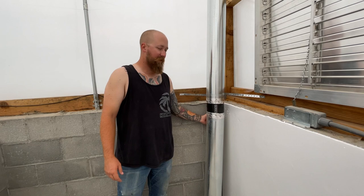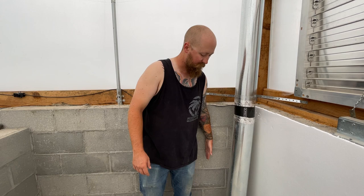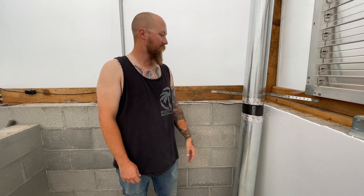And then this, I forgot to talk about this. So this is the geothermal tube. So we are just gonna use expanding foam, I think, and kind of go all the way around this and then put some of this in the front of it. So this corner will kind of just be cut off, be its own little foam piece. We'll just fiberglass all around it. So we're gonna start working on that. And then we are gonna finish foaming these walls and then we will be all ready for fiberglass, so.